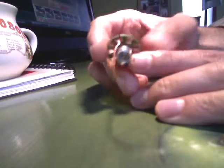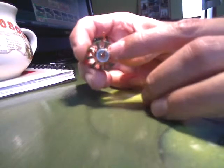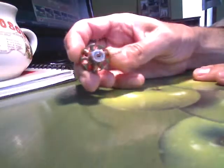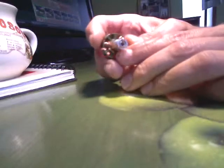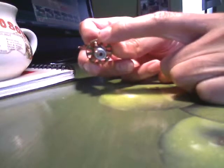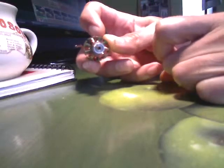The beginnings I always know because I tuck them in the hole where the bearing is. There's the beginning — this is going to go to one pole of the speed control, one of the wires. And all these ends are going to connect together. I'm going to start the next phase right next to the beginning of the first phase I did, which is going to be this pole in a clockwise fashion. I'm going to start winding right here at this pole.